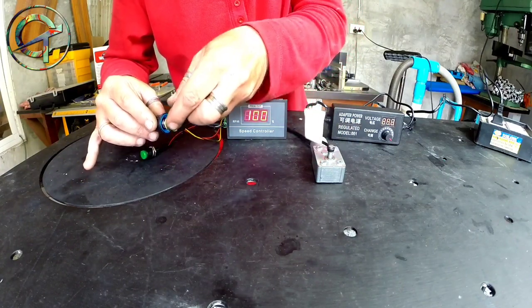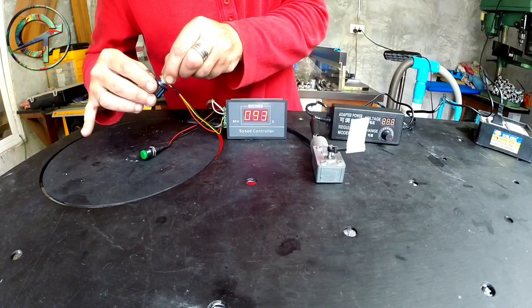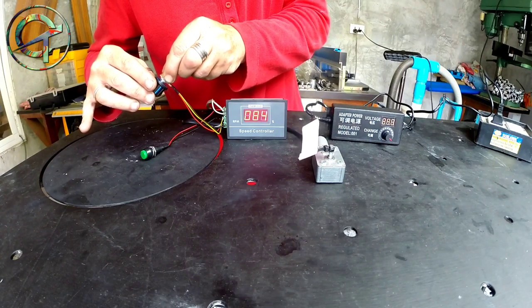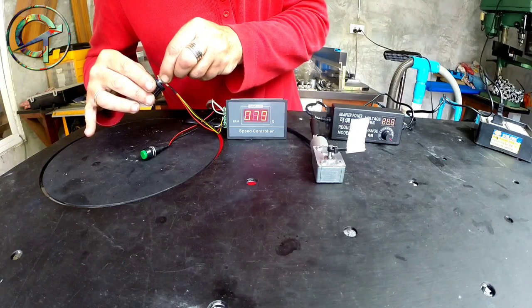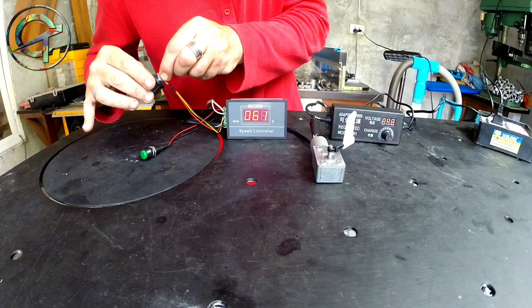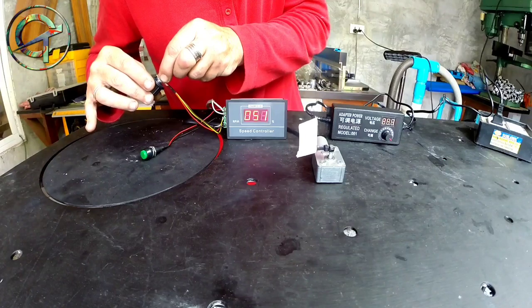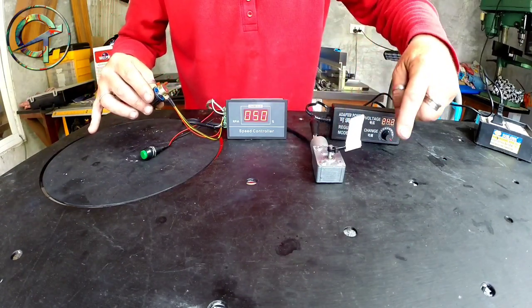As you can see, I can reduce speed through my controller, however, in this case, no power loss whatsoever. My DC motor, no matter its speed, keeps its torque constant. As we just saw, for an AC motor, a speed controller works on current, decreasing the wattage induced, as well as the motor power, the torque.